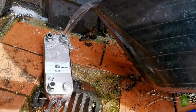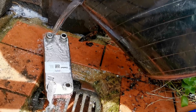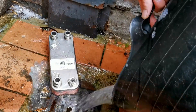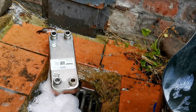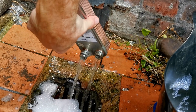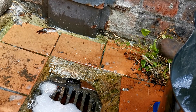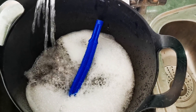I did video the descaling but my phone got too hot and crashed. It's quite simple: all I do is add the spirits of salt and keep pouring it in, letting it do its job. I stop once it stops bubbling up — that's when I stop. I've cleaned all my tools and everything I used. My gloves and everything that got spirits of salt on them are now washed and cleaned, and so is this.